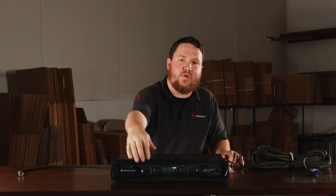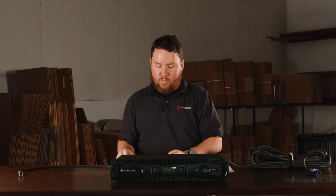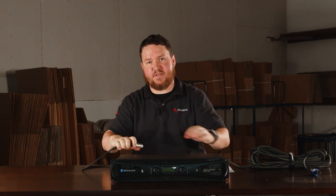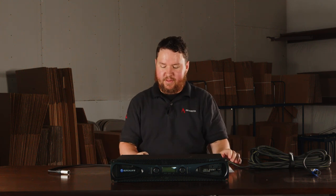I can control the volumes on the front of the amplifier to determine how much wattage I'm sending to my passive speakers. On the back of the subwoofer, I can adjust the volume level on the subwoofer's internal amplifier. We can do this same thing to feed multiple amplifiers — that's one way to feed lots of amplifiers in a single rack, or feed a recorder. This makes for an easy way to add more speakers, or in our case, to add a new powered subwoofer to our system.